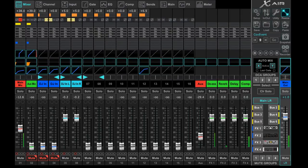Here's the software — you can see my microphone running in on channel one. This looks just like a standard mixer: volume controls along the bottom, mute buttons to mute and unmute channels. All 16 channels are here, plus an auxiliary channel for USB playback from a flash drive plugged into the front. On the far right you see four effects slots — we'll go over those in a minute.